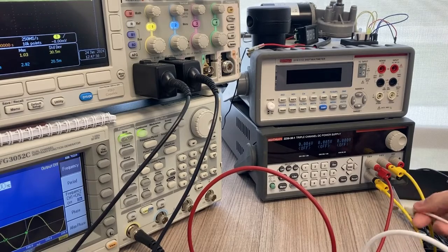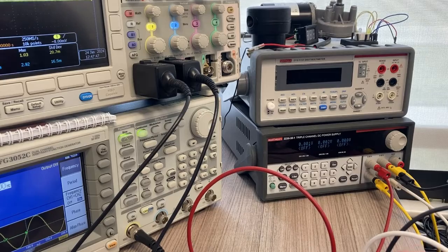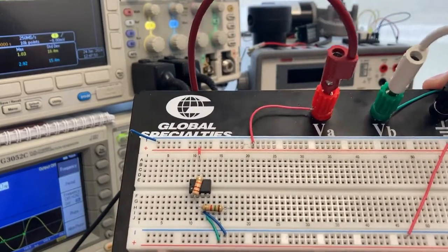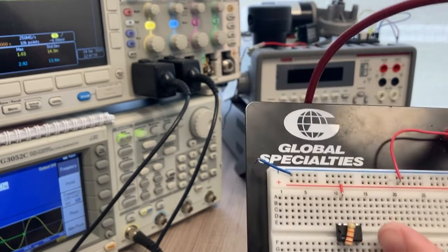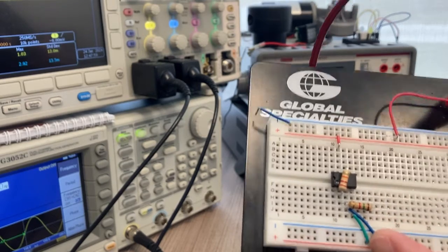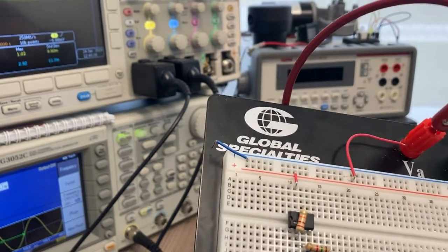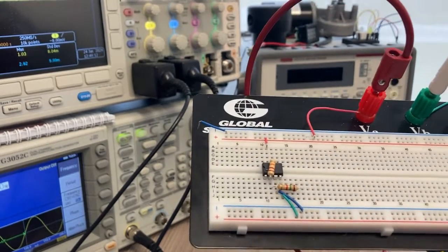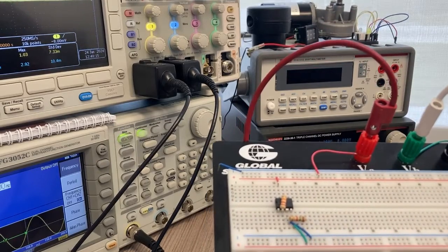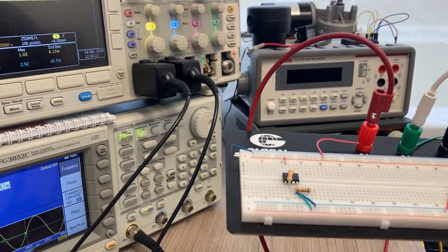I treat this as my negative VB and this will be ground. Pay careful attention to the pinouts. I have the pinout for ground connected here, along with the negative voltage supply, and I already have my circuit configured for an inverting amplifier. We're shooting for approximately a gain of negative 15 — in my case it comes out to about 14.8. Part of the lab is that you should measure your values and compare theoretical gain with nominal values versus real measured values.